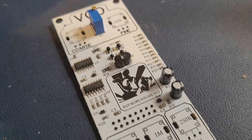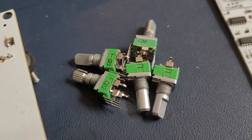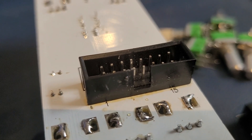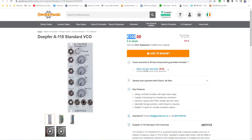What I'll make available is the PCB with all the surface mount components installed. What you'll need to source on your side is all the pots, the jack connectors, and the IDC connector to connect that to your rack box. The VCO itself will probably go for $35, and then plus parts it'll probably cost you $40 altogether, as opposed to much, much more.